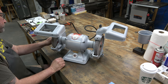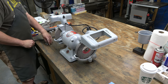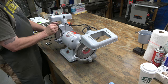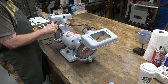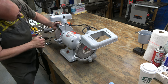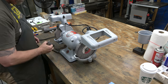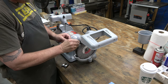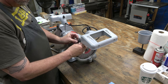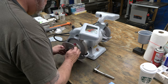Both of those wheels got large flat washers on them, and then they get the nuts. The left side has a left-hand thread. Here we are with the spark arresters. When I start spinning the wheel, you'll see how the wheel is kind of floppy — that's because the wheel is not centered, and the same problem exists with the other one. But that's an easy fix; I've got the proper bushings, I just didn't put them in at that time.